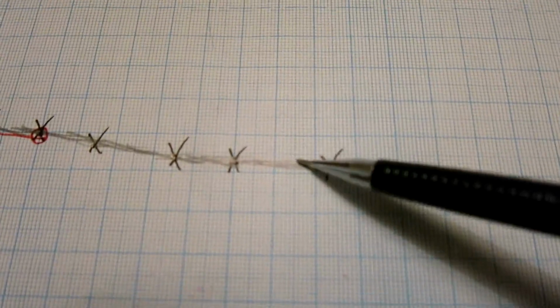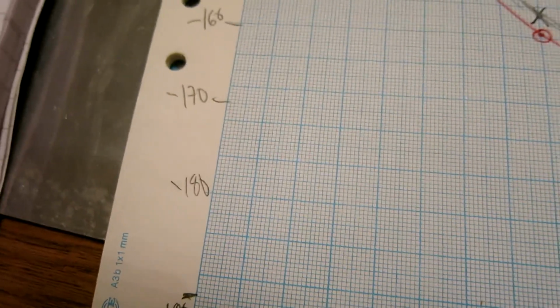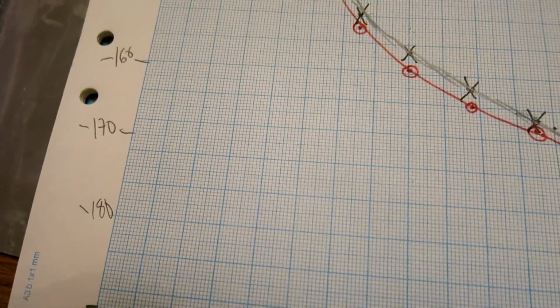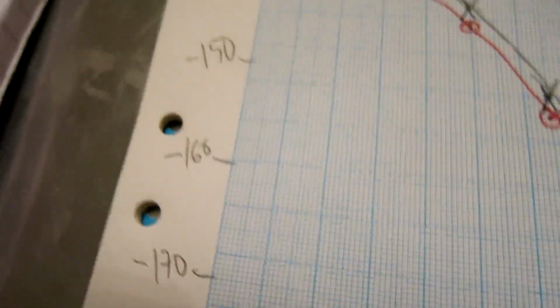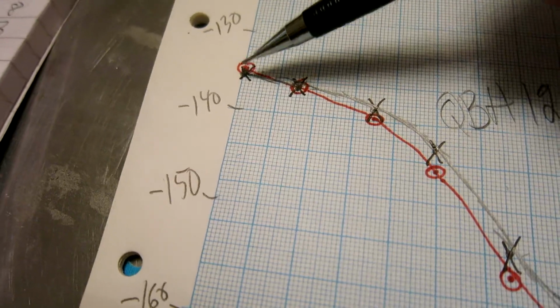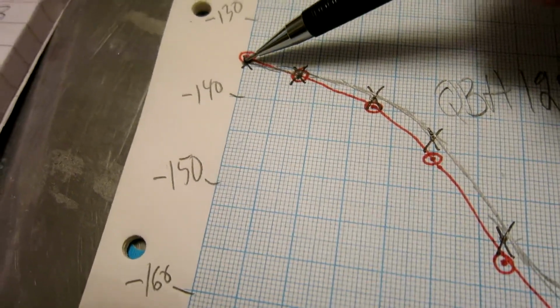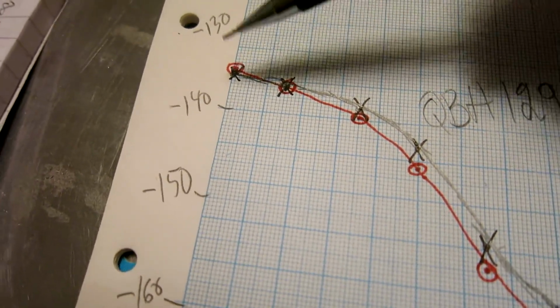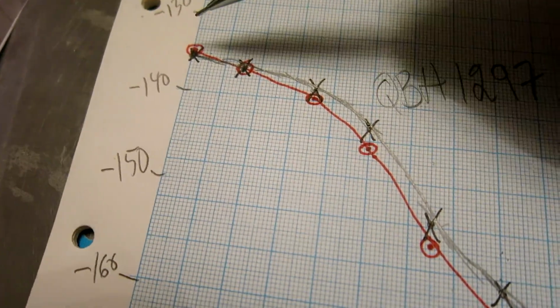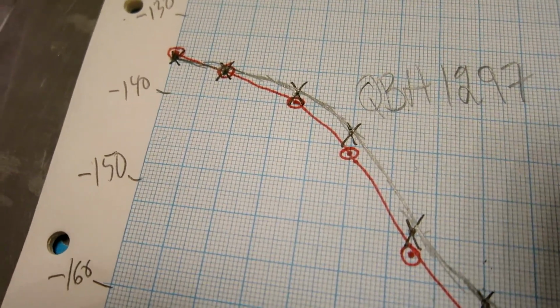So what I see here is that's the noise floor, minus 180 or a little bit more dBc per hertz. That's given by the noise figure of the amplifier. And at close range, say 1 hertz, the noise is minus 135 dBc per hertz. And at this close range, the noise is not depending on the size of the capacitors. It's probably defined by the voltage regulator.